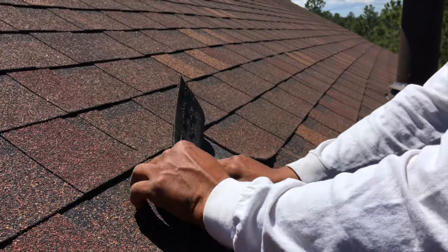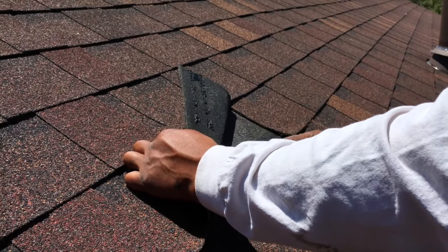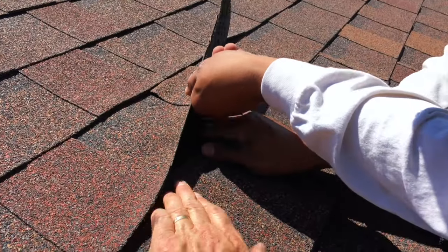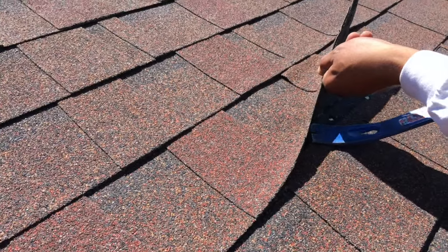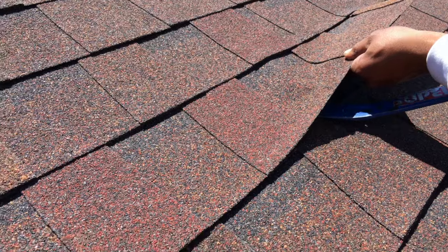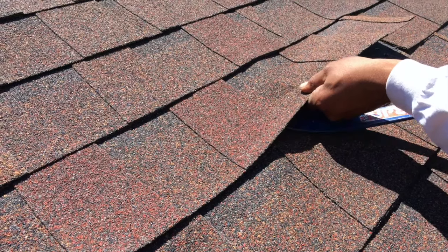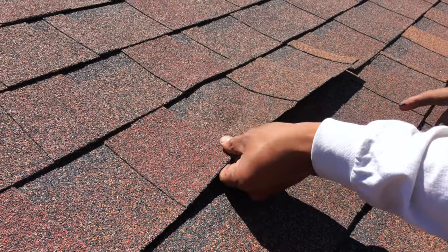As we're removing the upward shingles, it's pretty hot outside. We've located moisture under two shingles. We're checking this third shingle to see if we find moisture up in here. One is visual, the other is with our hands in there, feeling it before it evaporates in the heat. And we're not feeling any moisture, not finding any moisture at this point. I think we've determined where the leak is.